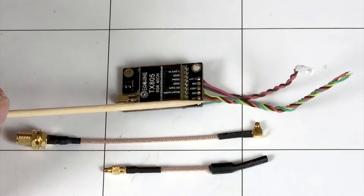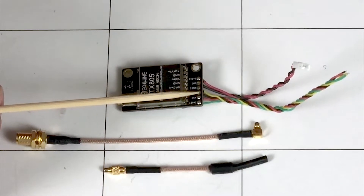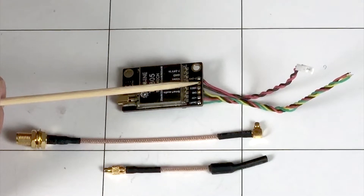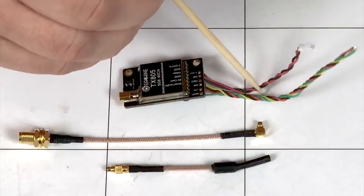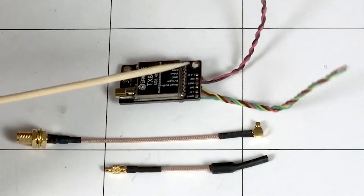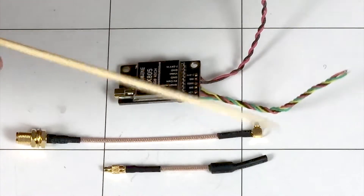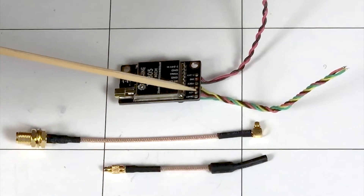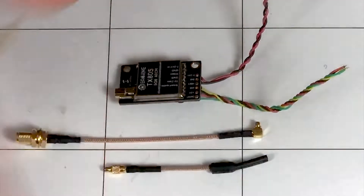So you have the green wire, which is your smart audio pin going to wherever your smart audio is coming from. You've got your 5-volt for the camera, your ground which is the black wire, and your yellow wire which is your video wire. Then down here you have your ground cable and your 7-to-24 volts input. This end of the harness is your power cable — it needs 7 to 24 volts, so you can hook this right up to your regular battery and off you go. Coming out of it you hook up your video out from your flight controller to the video pin, your ground and 5-volt pin for your camera, and your smart audio pin which goes to your smart audio pin on the flight controller.